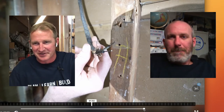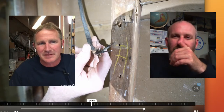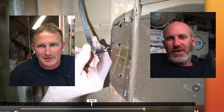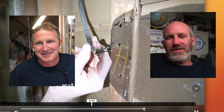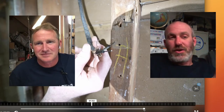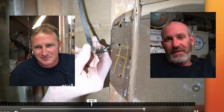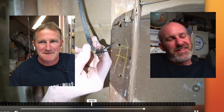If you put a GFI on here, as long as it's not connected to a whole bunch of other things in the home, that would be a way of making that outlet point safe. But really it's not even a conversation — when you open the walls, everything has to be brought to code. An old BX cable air splice can't be brought to code, so it has to be removed. If the wire goes to another room and you don't want to rewire further, you could put it in a junction box at the nearest point and run new wire to that point.